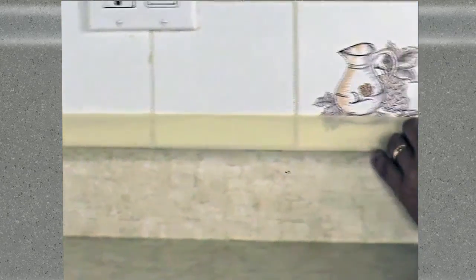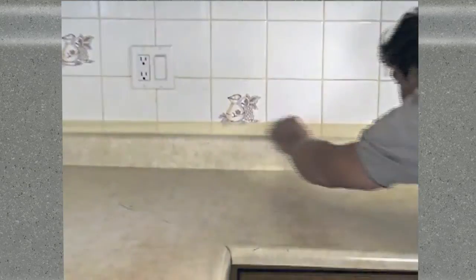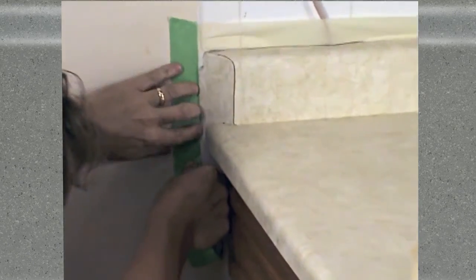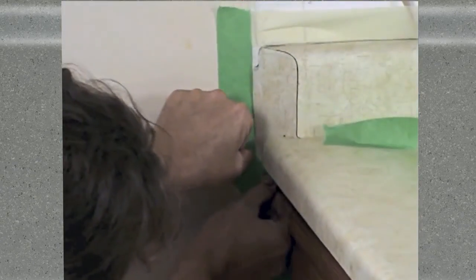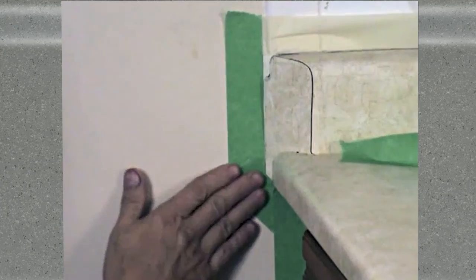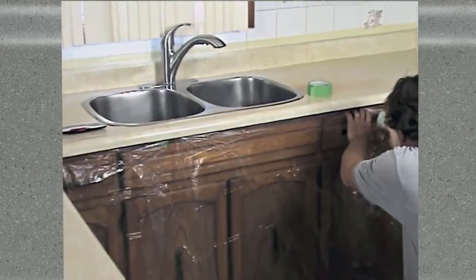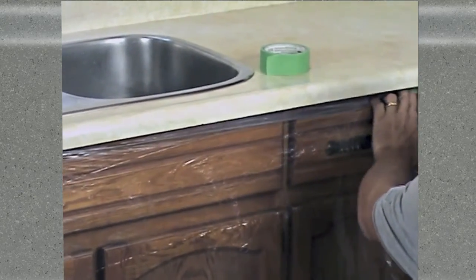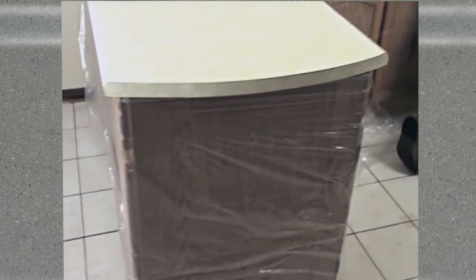First we're going to apply masking tape carefully along the edge of the countertop backsplash where it meets the wall tile. You will also need to mask painted wall surfaces carefully where they meet up with the countertop. To guard against damage to your wall paint, use painters tape to avoid pulling paint off the wall when you remove it later. Take your time to ensure that the edge you are creating is crisp and straight for an optimal overall appearance when the job is done.